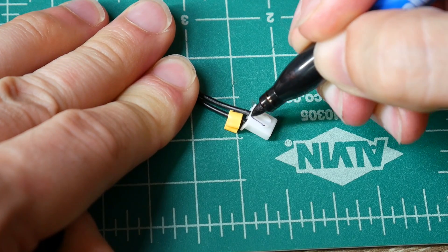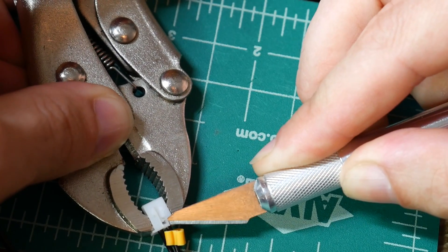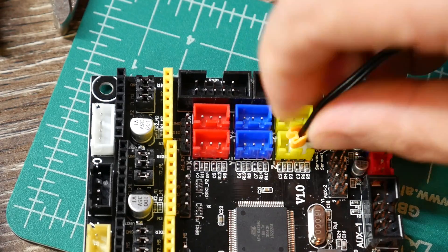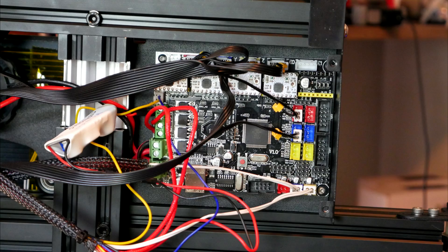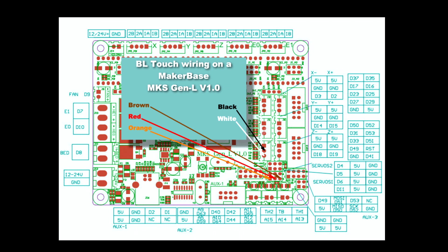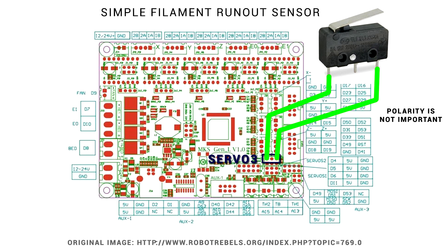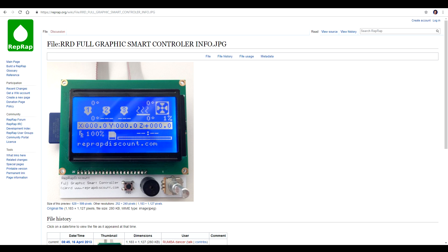The only plugs you need to modify in the whole thing are for the end stops. There are two locking prongs — mark and then cut off the left hand one. It's pretty fiddly and easy to cut your finger. After this easy modification, they'll plug straight into the end stop switches using the correct two pins of the three available. Here's the X and Y in place, but I've left Z free because I have a BL Touch. Your BL Touch plugs directly in — there's a link to the wiring image in the description. I've also set up filament runout detection as covered in my previous video. I've chosen not to upgrade my LCD to one with an included SD card, so I'll lose that functionality for my install.